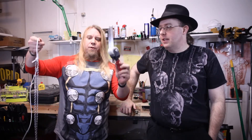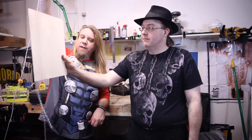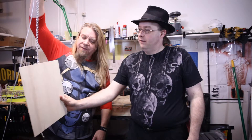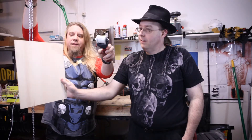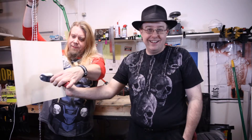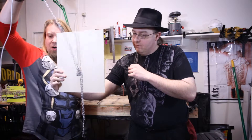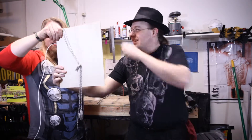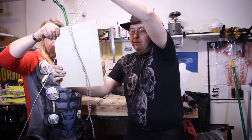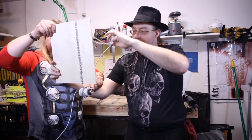This is one of the actual magnets that comes in the magnet pole — this is the wand, as they call it. So once this is in the wall, let's say you can't get to the drill hole you made, you can't find it, or it didn't line up right. This has got a very powerful magnet on the end of this wand — don't put it near your wallet. You can see now I have gripped it and I can go left and right with it.